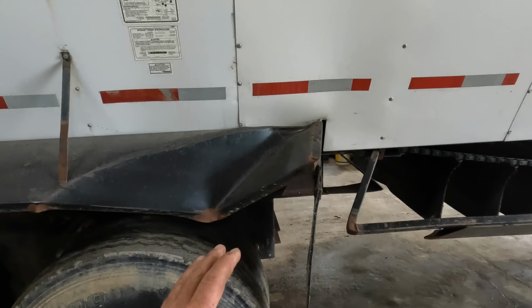All right, so we have this tarp all out, and well, it's on there. However, what we need to do now is we need to fasten the tarp to the tube. Therefore, when you roll the tube up, it will actually roll the tarp. So we've got these little plastic clips that we took off of the other one that we'll go ahead and put on this here. We'll have to drill a hole into that metal pipe, put the screws in, latch that all the way down through. And then that will allow it to roll from one side to the other. It looks like I need to push that pipe forward just a little bit.